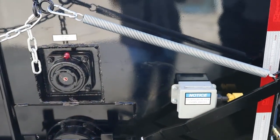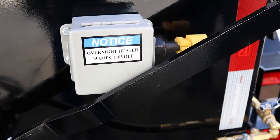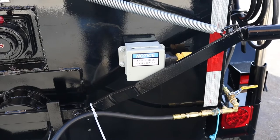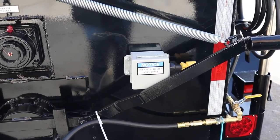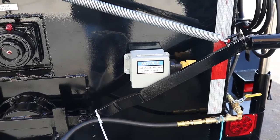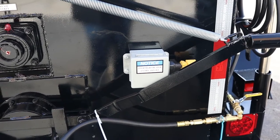The unit is also equipped with double overnight heaters. They just plug into a standard extension cord to the wall. The intended purpose of these is to keep your oil around approximately 100 degrees — it's not meant to keep the oil at full temp, it just cuts down on the initial startup time in the morning.